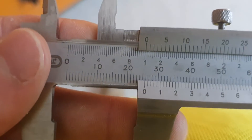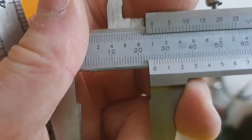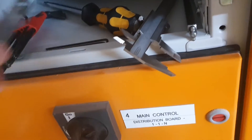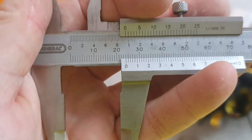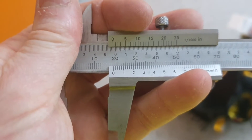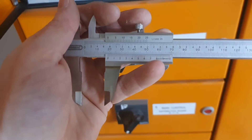So that's the measurement again for the pano. We need to take a millimetre off for the ruler - sorry, it's hard to do one-handed. Take a millimetre off for the ruler, about there. And then the depth of these - that's five mil, I measured that just then. So we need to take off another five mil. So what are we out here? We're at 24, so we'll go back to 19 millimetres. So 19 millimetres plus our original depth measurement, minus all the allowances for the steel and the ruler and everything - that brings us to the grand total of 143 millimetres or thereabouts.